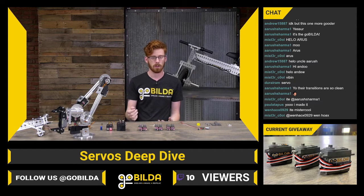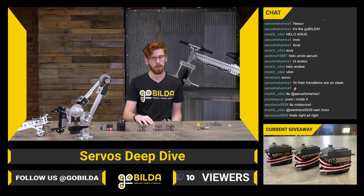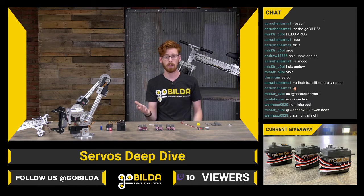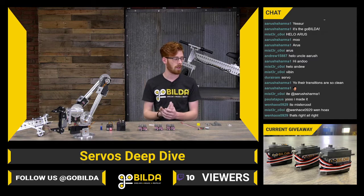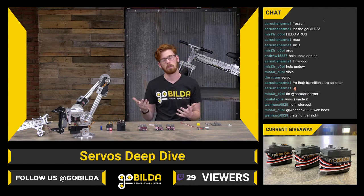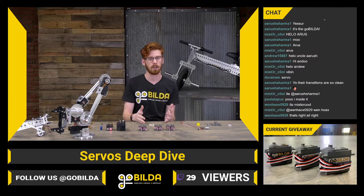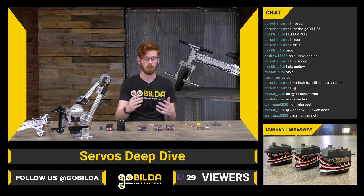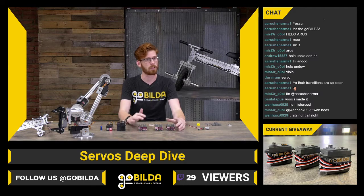Plastic has a really great advantage if you're using a nice quality plastic. It can run for a really, really long time, compared to something like a steel gear, which may not run for quite as long without just wearing out. But that titanium or steel gear servo will be a lot better at taking shock loads and overall loads from a servo in general day-to-day use.